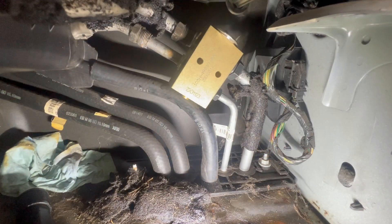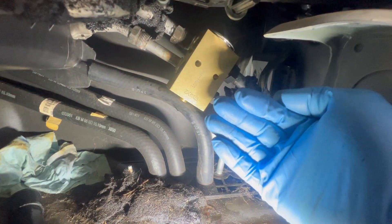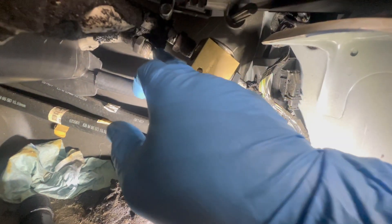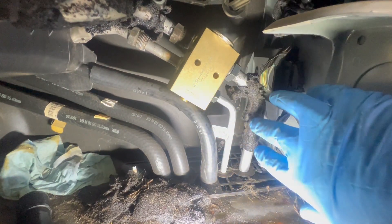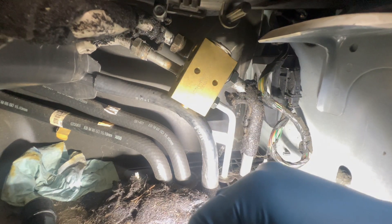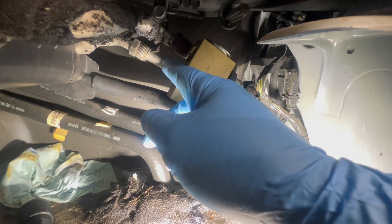Here's the technique I use to get the block in here: you can pull these lines out towards you relatively easy without getting rough with anything, get both of those started snug. Then take both these lines — since these lines are pretty solid where they go into the box — push them back a little bit and get both lines going into your ports. Make sure you don't cross-thread anything; they start by hand really easy. Snug them up, just barely, so you can still twist the block a little to line them up.